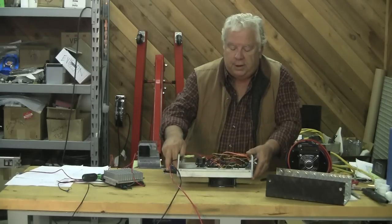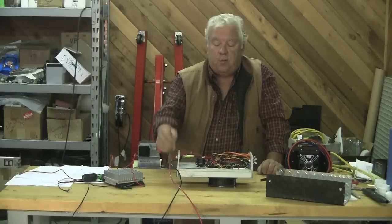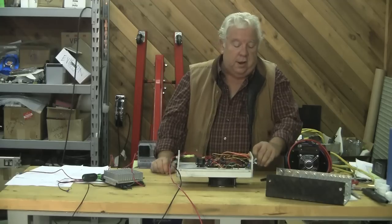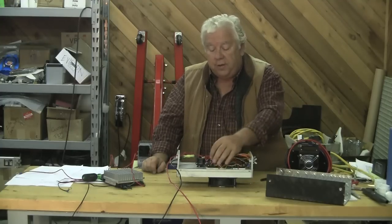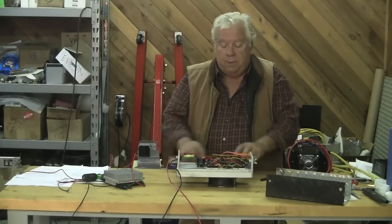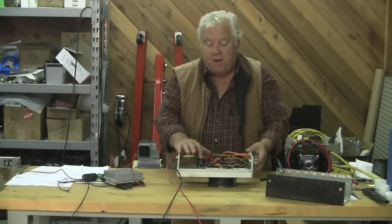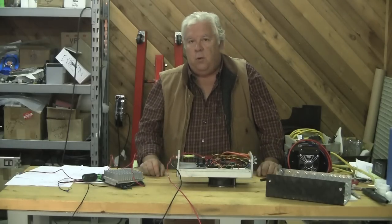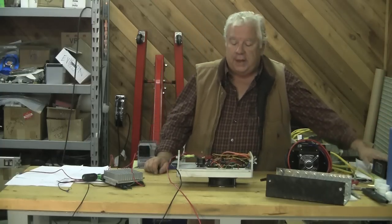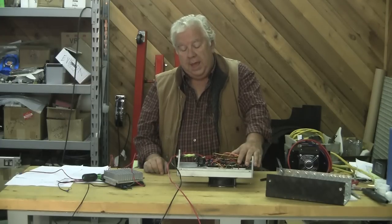There's no design circuitry here — nothing. You don't have to design a power supply. You're simply wiring up three of these in parallel and doing some control with a relay and a switch, hooking up the wires. It looks like more than it is. The heat sink is about $20, the three bricks were about $20 each, so we're at $80. A switch for $5 is $85, a relay for $10 is $95, and a fan for $10 brings us to about $110 — less than the cost of the Kelly. This thing will put out 1500 watts; I've tested it for an hour at 300 volts in at 120 amp output.